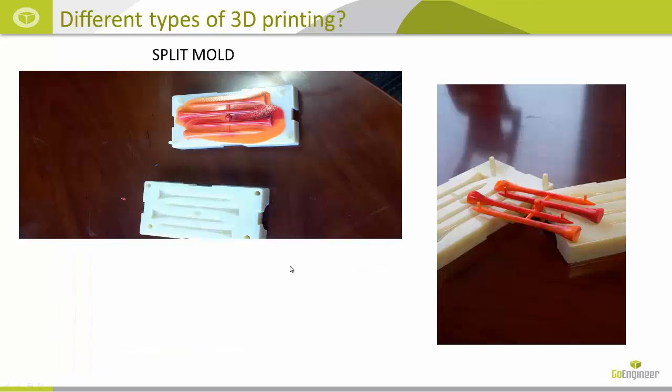The next picture shows the mold in half. It's got a little bit of flashing around the golf tees but that was trimmed up fairly quickly. You can see material in the vent holes and there's the injection point.